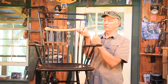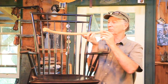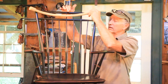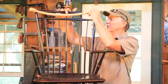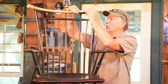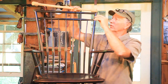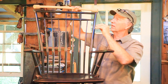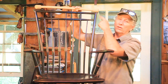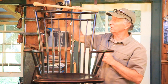If the joint was 90 degrees to this bending plane, then this would tip down here — that's an exaggeration — but it would tip down because the posts lean back. That's not what I wanted. I wanted it to have a crowned look to it, so it's got to be rotated. We have to figure out where that hole is going to be bored and the angle that it's going to be bored.